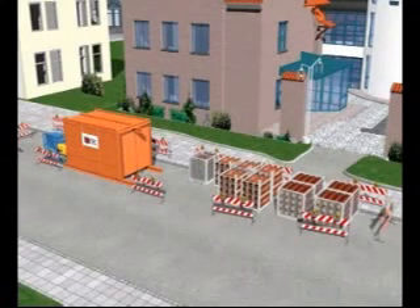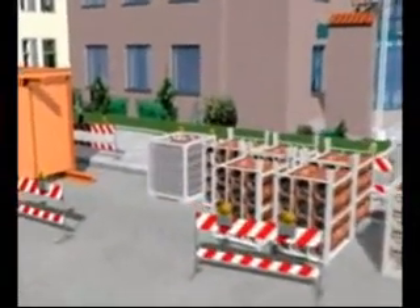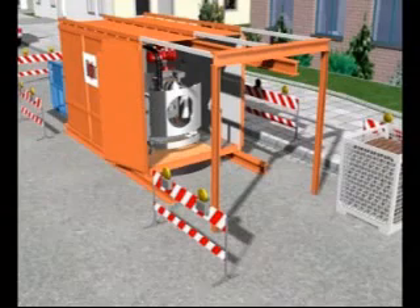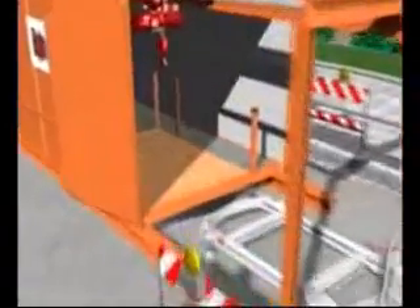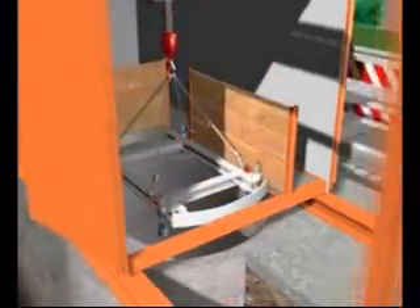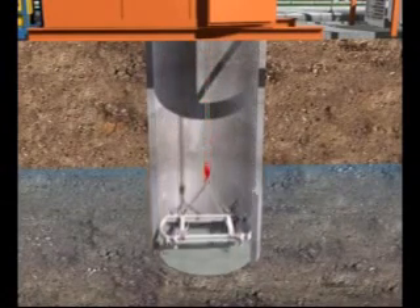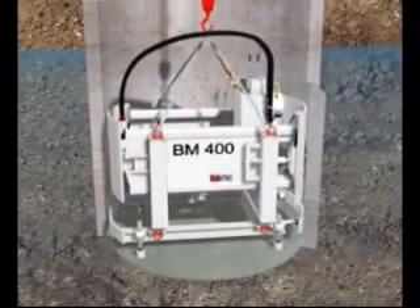The compact site setup consists of the boring container, the hydraulic power pack, and racks for the pilot tubes and auger casings. After positioning the boring container above the launch shaft, the crane is extended so that the BM400 machine and base frame can be lifted out of the container by the 2.5 ton hoist. The cover boards are removed from the floor opening and used to form the guardrail around the top of the working shaft. The base frame is first lowered into the shaft and easily set for height, grade, and line before being braced in position. The BM400 is then placed on the base frame and fixed in position.